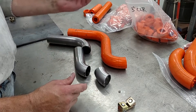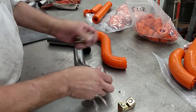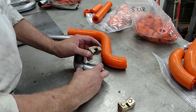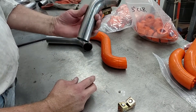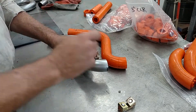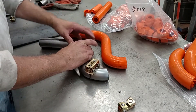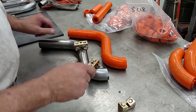Fortunately I've got these little guys here — they pivot around and they've got magnets on them. The nice thing is I can take this part, get him in the position that I want, and then go like that and bam — you've got your part. Now you can come in here, tack him in place, pull that guy off, and fully weld him. In this case I'll grab the other side, put him in the position I need, snap those guys on there. The nice thing about these little tools is they've got magnets on both sides.